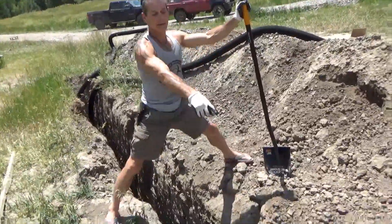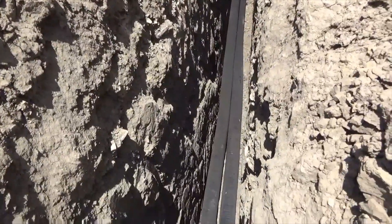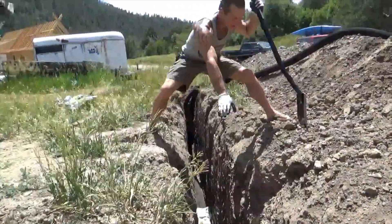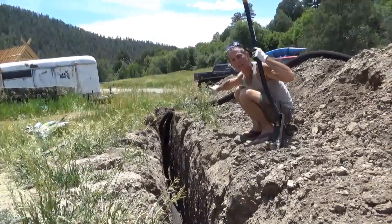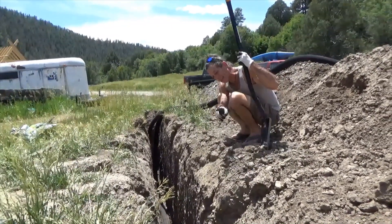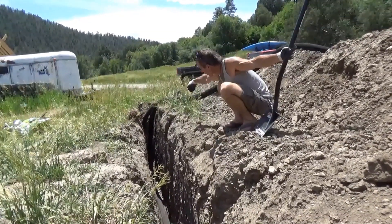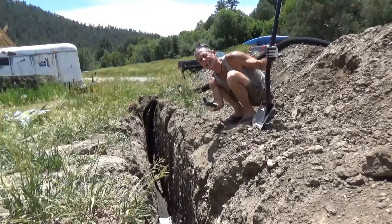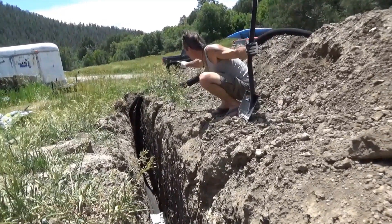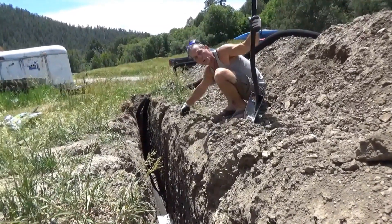What we have is two four-inch tubes at depth — these are the intake tubes coming into the house, not the tubes coming out. These are going to double and curve up, coming back at about five feet into the greenhouse as the outlet. So the greenhouse outlet is at five feet. At 150 feet, the tube curves down to 10 feet, picking up that 54-degree temperature all the way in. That's how you do an earth tube: closed loop, out at five or six feet, in at 10 or 12 feet. You take the hot air out, bleed it into the surface, and cool that air the whole way in.